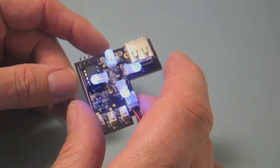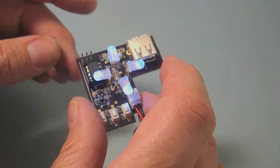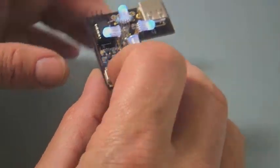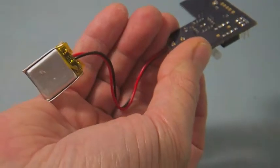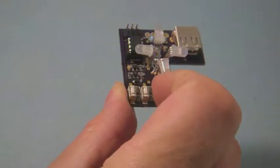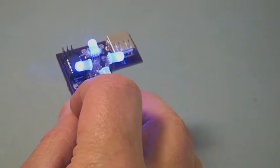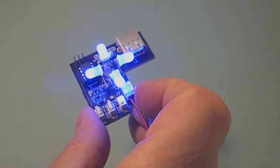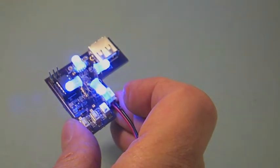Obviously we could try to get back to some behavior that we preferred, or we can restore to factory state, again, by using that select button, but this time you want to boot up while holding the select button in. So I'm going to hold the select button in here, again, turn it over, which cuts power because of the tilt switch, and it powers up. It has, let us click back through, returned to normal behavior. It has reset all of the factory values.